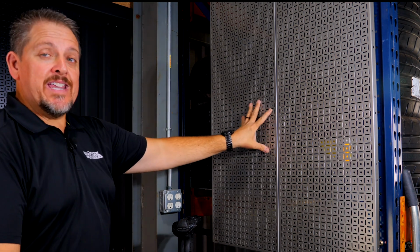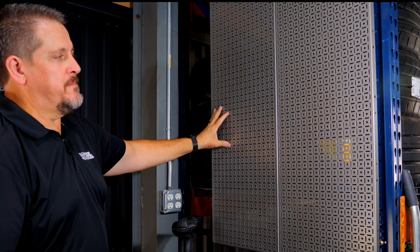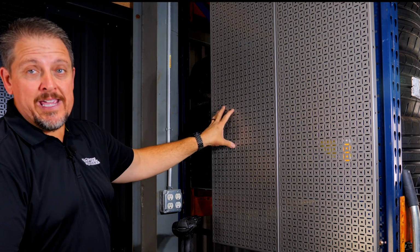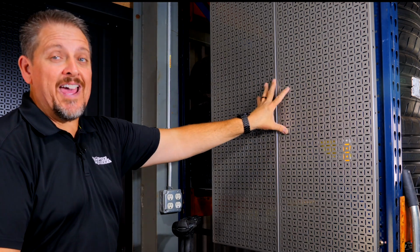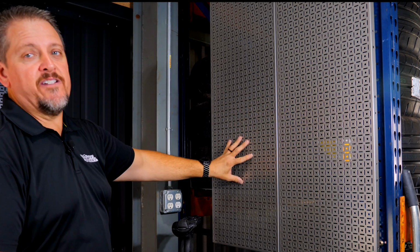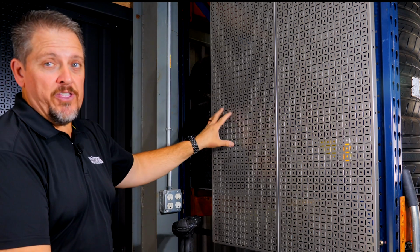They mentioned that if you're going to install large accessories, so big shelves, big bottle holders, whatever, it will be easier to go ahead and install these now and build the cabinet around it. It can be done later, but if you're already planning, go ahead, mount your larger accessories, and then build the cabinet. We're going to go ahead and just build the cabinet, and the sides are going to hang first.